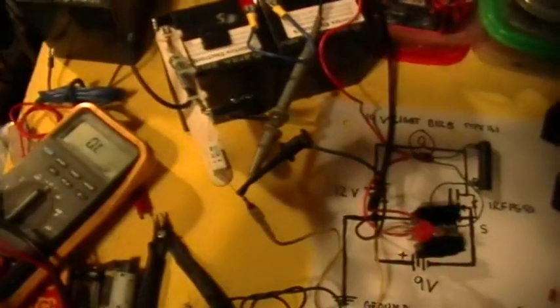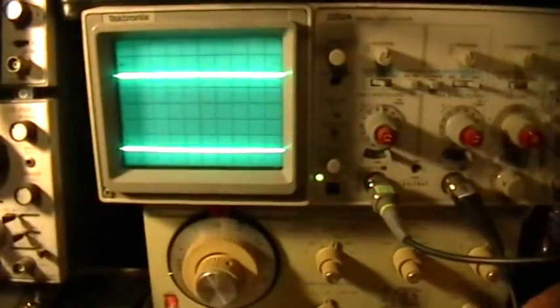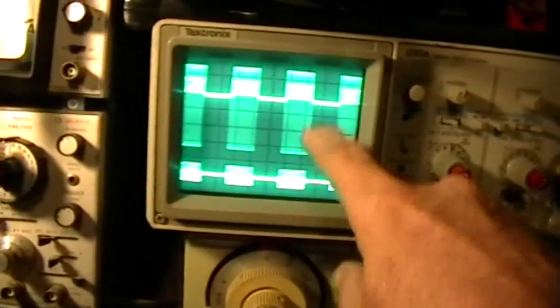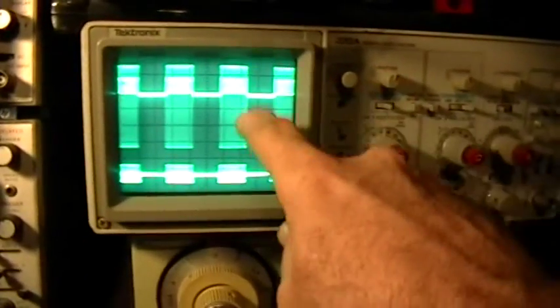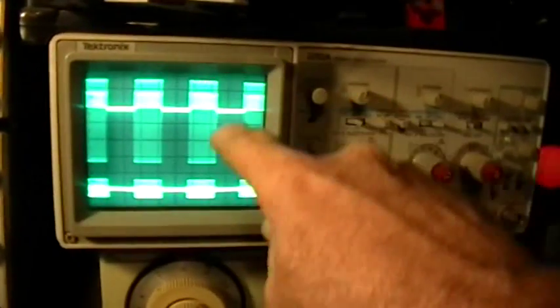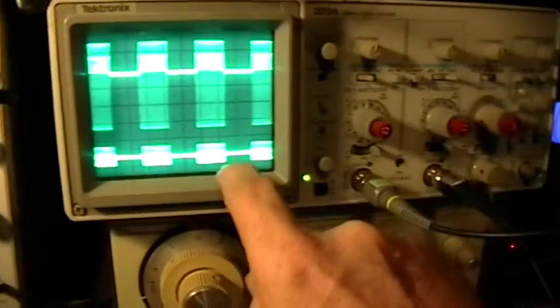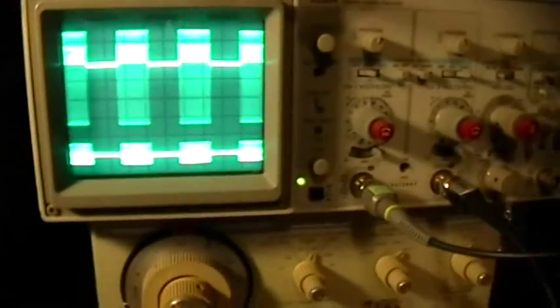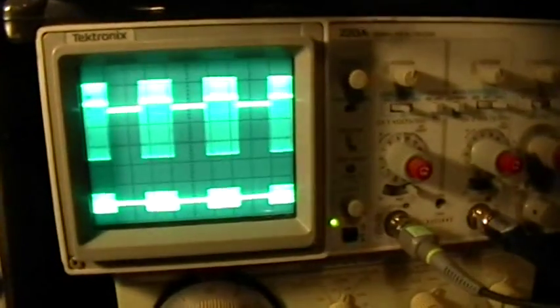And now, since I have my function generator isolated, there's no ground loop possible, I can hook up the black lead of the function generator on the correct side, the transistor side of the current viewing shunt in this situation. And the waveforms that I get are the same. The magnitudes are a little bit different, but still, as you can see, I get much, much more amplitude of oscillations with the wire-wound concrete resistor. I get huge oscillation magnitudes, huge indicated currents, and with the non-inductive resistor, I get much smaller indicated currents. Okay, which one do you want to believe? Huh? I know which one Ainslie wants to believe, and I know which one I believe.